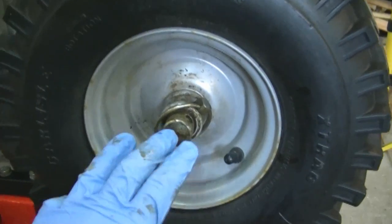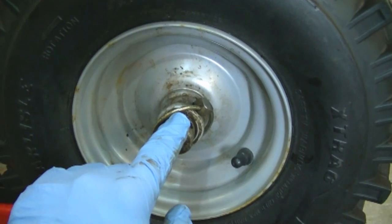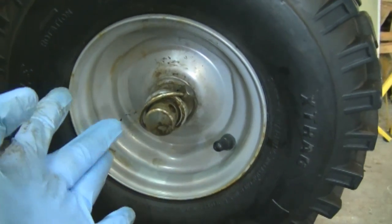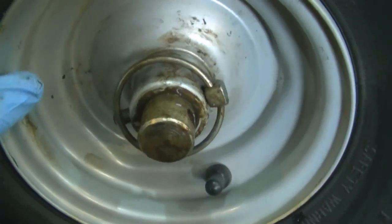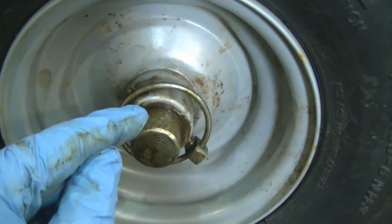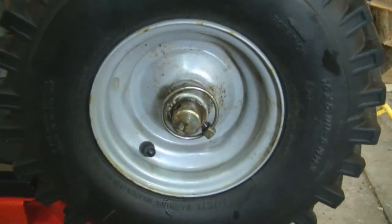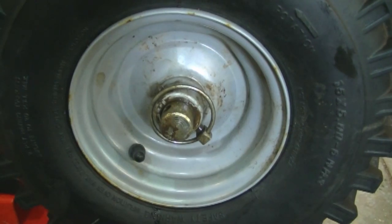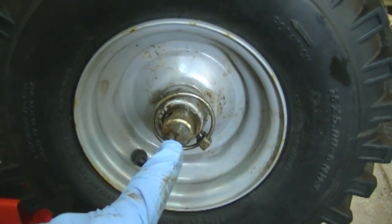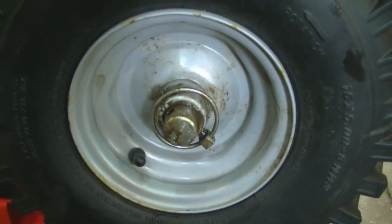The reason I don't use expensive grease is that the wheel is basically stationary on the shaft — I just put grease or oil on the shaft to prevent rust and to prevent the wheel from seizing. Once you put your grease or oil, spin it so it saturates all the parts. For parts that are rubbing and turning constantly, I'd use low-temp grease or lithium grease. If you don't grease or oil it properly, your wheel can fuse to the shaft when you go to remove it. That'll be it for this week — thanks for watching, have a great weekend, and we'll see you next Friday!